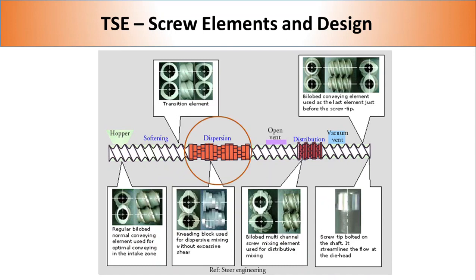The most common elements in a twin screw extruder are conveying elements, kneading blocks, and flow restrictors. The number and location of these elements can be easily changed. Kneading blocks provide a high amount of shear, helping to achieve excellent dispersion of additives. However, if the polymer is sensitive to extensional flow, having a kneading block can be a problem. Flow restrictors reverse the flow of polymer melt, allowing additives to mix properly in the polymer matrix. Depending on the difficulty of dispersion, a typical twin screw will consist of one or more sections of kneading and flow restrictor blocks.